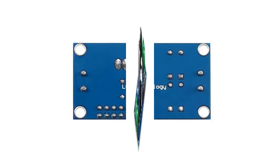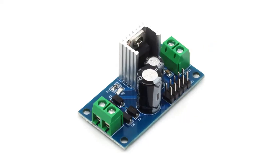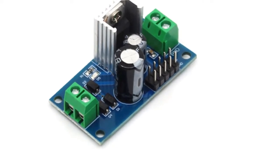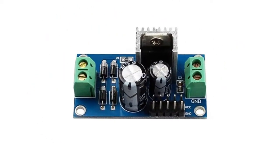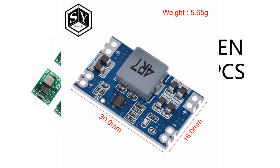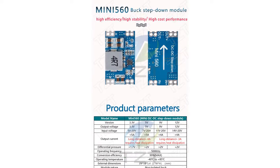Each of the modern electrical voltage regulators work by comparing the output voltage to an internal fixed reference voltage. The difference is amplified and used to control the regulation element in the correct way, which will aid to reduce any kind of voltage error. When this happens it will form a negative feedback or servo control loop, which will step up the accuracy of the regulation.